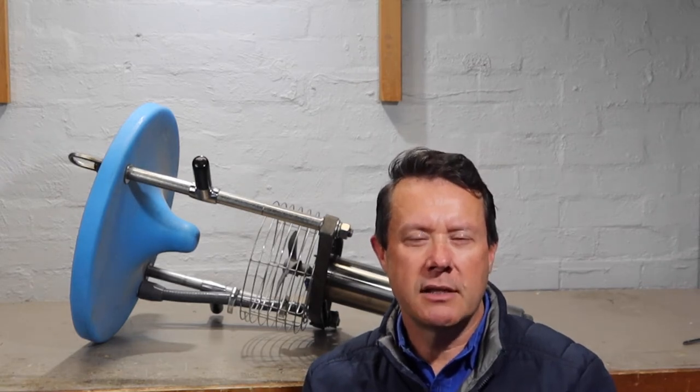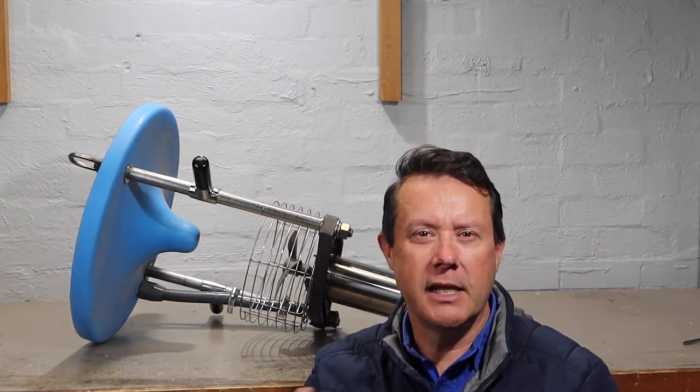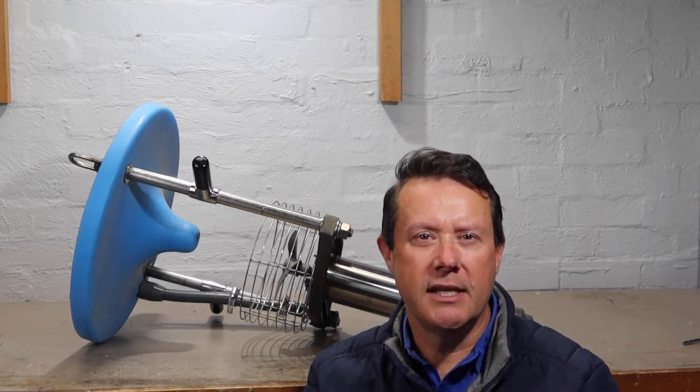They replace large power-hungry aerators, some of the ones that have been in treatment plants since the 80s and 90s. The reason they're good at replacing these units is because they're small, lightweight and modular. That means you can have the same amount of horsepower or kilowatts in a pond but spread that out amongst multiple units, allowing you to turn multiple units on and off based on your need and power consumption.